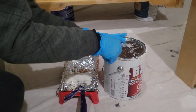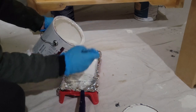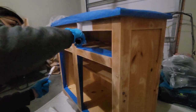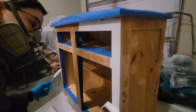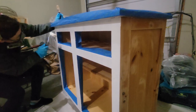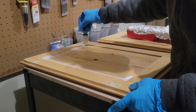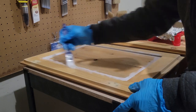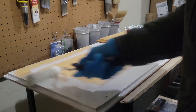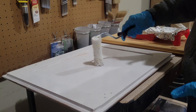Now that everything's taped up and ready to go we are on to primer. I like to use Zinsser's BIN shellac-based primer. It is really smelly so you should be wearing a respirator to protect your lungs, and this is why I use gloves — it's really hard to clean off your hands. I just use a microfiber roller and toss it away when I'm done since you need ammonia to clean this type of primer. I'm using a cheap chip brush to get into all the cracks before I use the roller on the doors as well. This primer dries really quickly so you want to work fast — try not to go back over the spot you just did or you will end up getting roller texture.